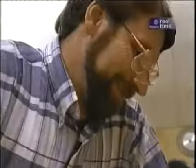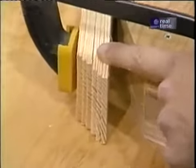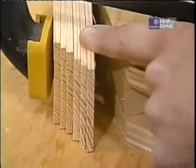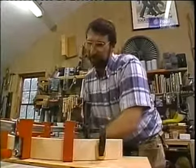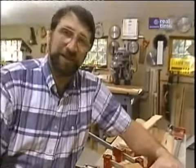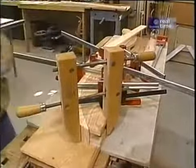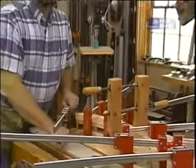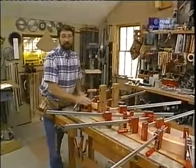I understand they make violins and guitars the same way. Now you can begin to see how the boards will slip by one another a little bit — that's what's supposed to happen. If I get real good at bending forms like this, maybe I can try a spiral staircase someday. Do you remember that line — too thin or too rich? I would add to that: you can never have enough clamps. You're going to have to let these rails sit in the form for at least 12 hours before they're unclamped, and at that time they'll actually stay in the shape of the form.